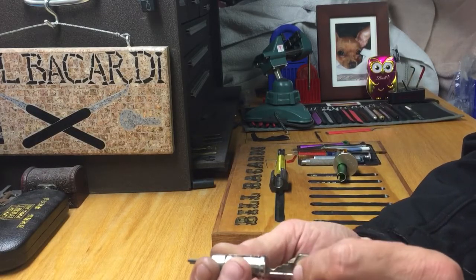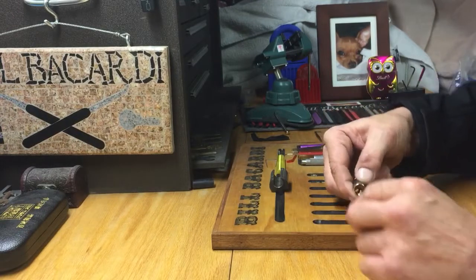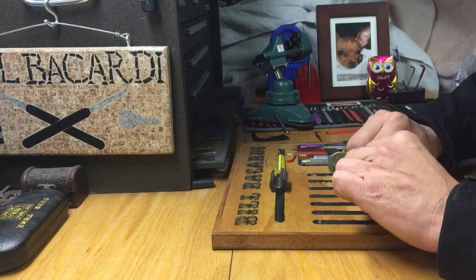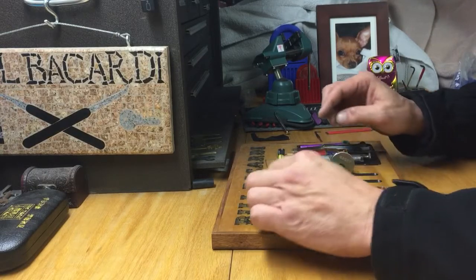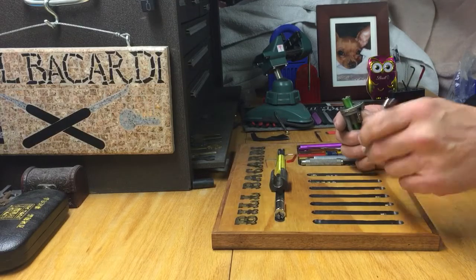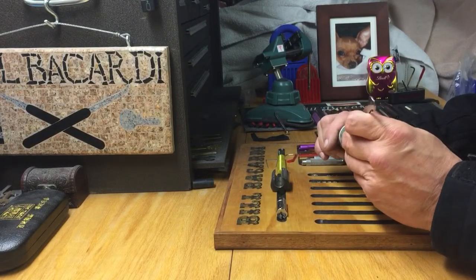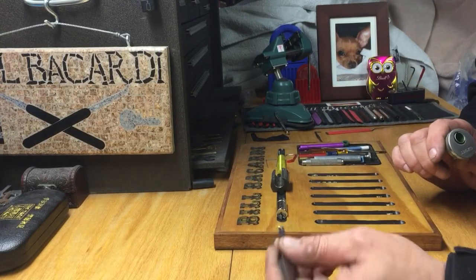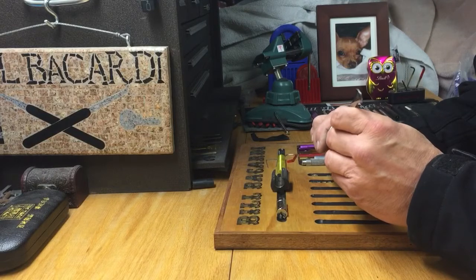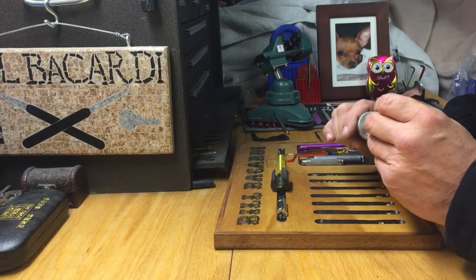So see, I had to change that number one pin. I don't know what I did with it guys, I'm really sorry Easy Pickings. He did a really nice job on this lock. After I knocked it down I had already erased the video. Nothing's done to the core — nice. Let me know on this one Easy Pickings if you see something that's not right in this lock beside this number one pin, because I don't remember if that was a serrated or what it was. I don't know where this pin came from — it might have just been laying on my floor — but it's definitely a Kwikset-style pin. It's got that rounded top and bottom on it, and that's the way Kwiksets are. One just came flying out of there, and this is the one that I put in. I'll show you when we get down to the pinning board.